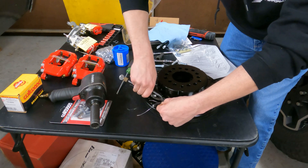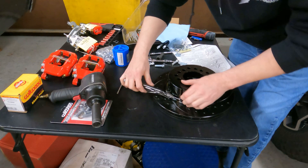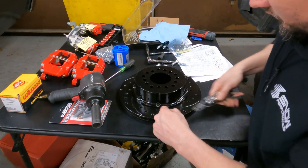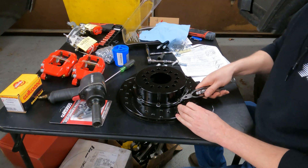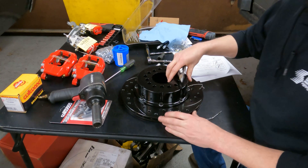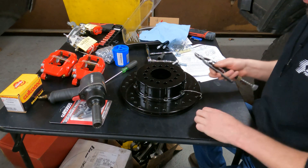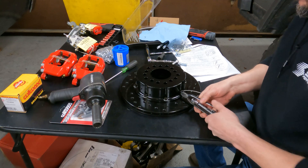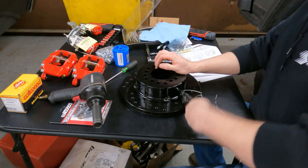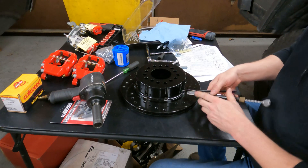It's hard to do this and stay out of the way. Get it nice and tight and see if it's wanting to walk over. Let's start over — it's not a good one. We're going to try and feed it through the back side; I just don't think we have enough room to really do that. But we've got plenty of safety wire to keep practicing and make sure we get it right, because this is a safety device. Some side cutters would probably make it easier to get this off. This wire breaks pretty easily — that's why it's important that you never untwist a twist that you've done.